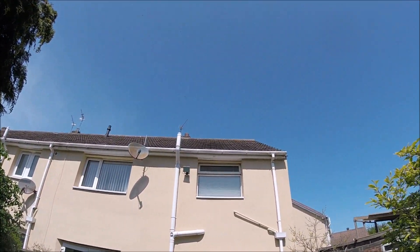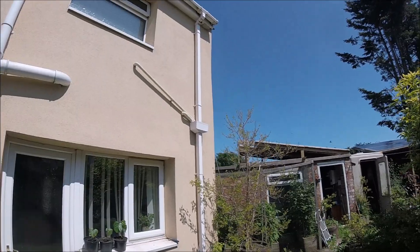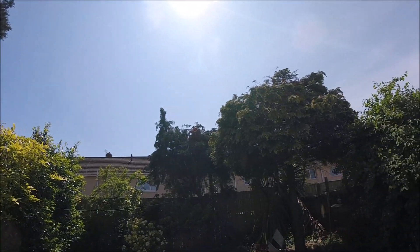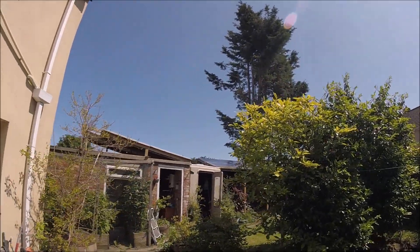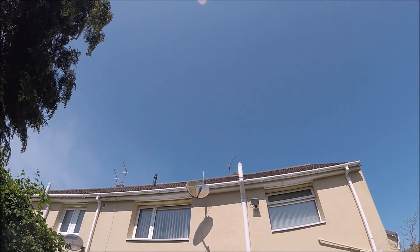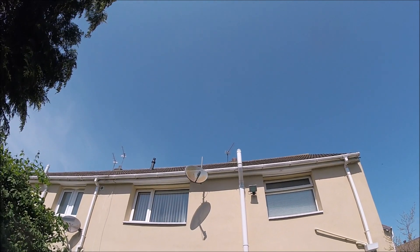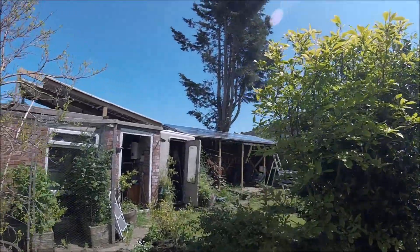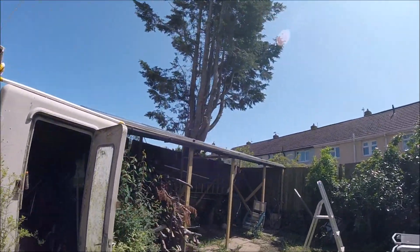As you can see, the house itself is in pure sun all day every day. The reason I didn't initially get them mounted on the roof was basically just for cost-cutting — I wanted to see how much I could generate in my back garden first, and I've been really happy with what they've done so far. But I have a south-facing garden so I might as well make the most of it, because during winter the sun barely gets above the row of houses in front of me and it doesn't even touch the two kilowatt setup. If they're up on the roof, they'll produce in full winter as long as the sun's out.